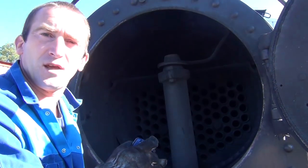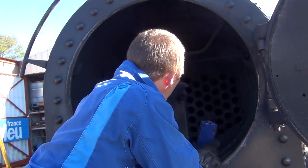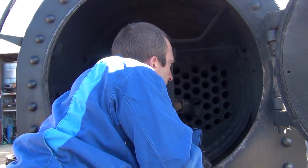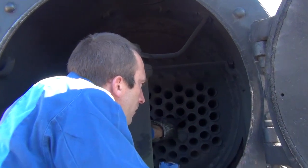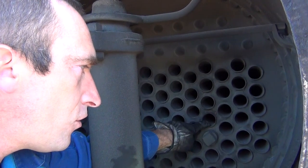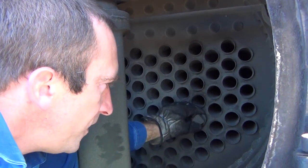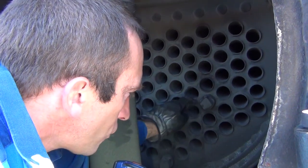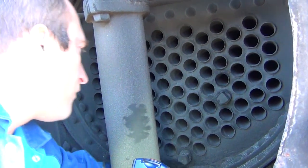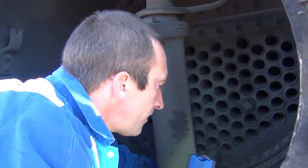And the driver, when he opens his door, sees the flames drawn right into the tubes. It is important to understand that the hot gases travel through these tubes, and that around these tubes is water — which gives a very large heat exchange surface. These tubes will be removed. I verify the absence of leaks at the bottom of the plugs, at the base of the boiler, and I have absolutely no leaks in the base of the boiler, which is perfect.